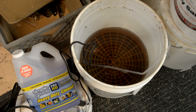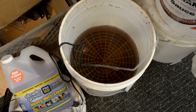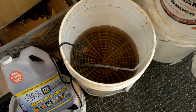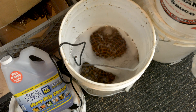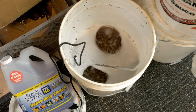I just have to make sure that any parts I put in there are either in a separate tray or not small enough to fall through the grit guard. Once I get my parts in there, I take my air pump and plug that in — that provides agitation. I find that five to ten minutes in there pretty much degreases most anything.